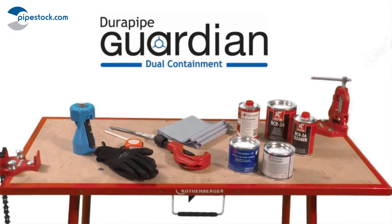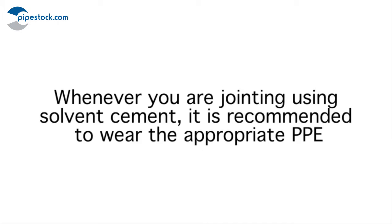The equipment you'll need to perform reproducible jointing of Durapipe PVC-U Guardian joint: pipe cutter, chamfering tool, tape measure and pencil, lint-free cloth or paper towel, Durapipe PVC-U one-step solvent cement or Durapipe RH THF-free solvent cement, Durapipe Eco Cleaner, stirring tool, paintbrush and solvent-resistant gloves. Whenever you're jointing using solvent cement, it's recommended to wear the appropriate PPE.